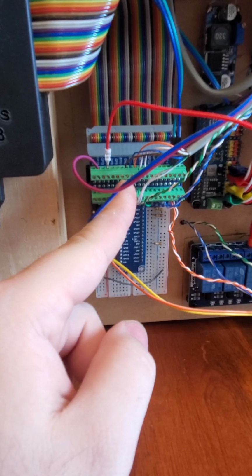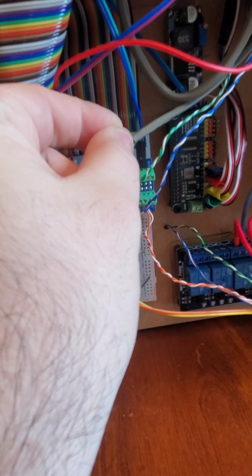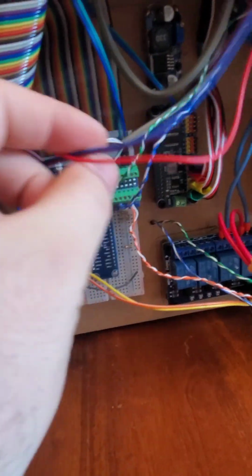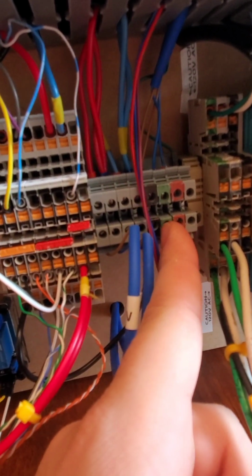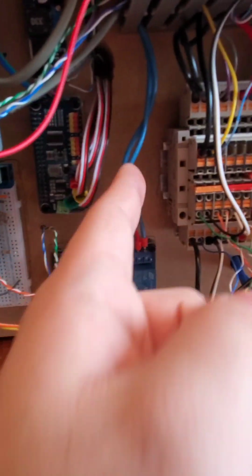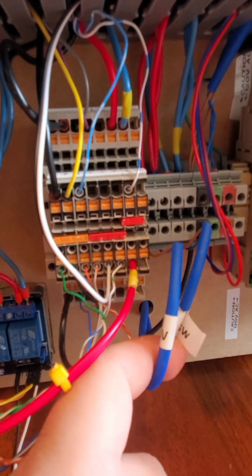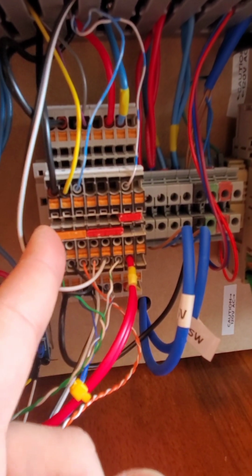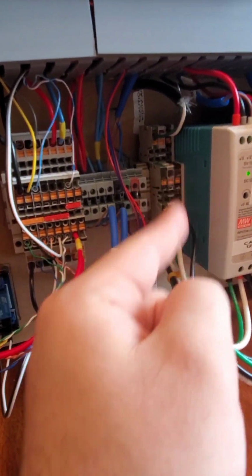I've got an I/O terminal block expander. This Ethernet cable here is running to the RFID scanner. These 3 cables here are running to some of my distribution here, which is my start, stop button, and conveyor enable. Along here I've got a 5-volt and a 12-volt DIN rail power supply, which run through the power switches here and feed my ground, 5-volt and 12-volt power distribution. I've got my 120-volt power distribution for my 2 power supplies here.